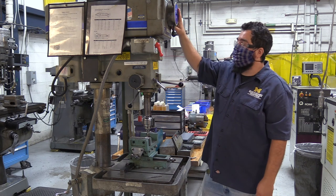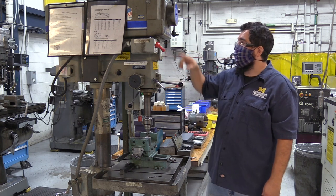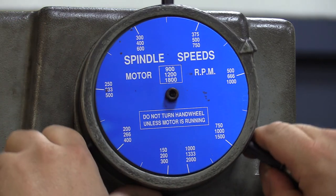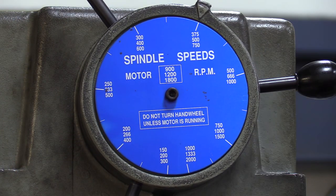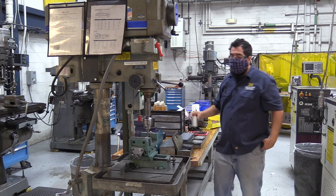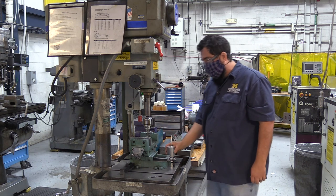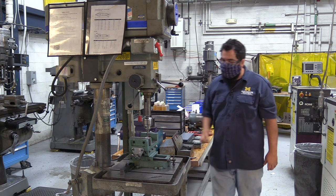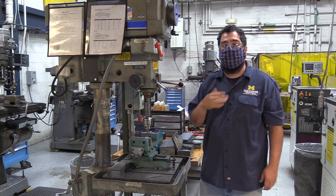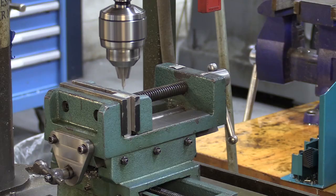The speed is changed with the tool on — so if I turn it on high I'm at 1500 RPM on the tool, and I'll rotate to 750. We're in a good spot. Before you actually drill, every time you drill I want you to use cutting fluid — doesn't take much, just a little dab. Remember we're only going halfway up the chamfer with the center drill, so I'm visually watching and staying in control.